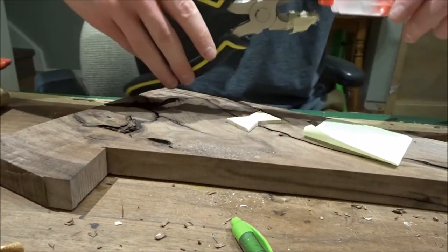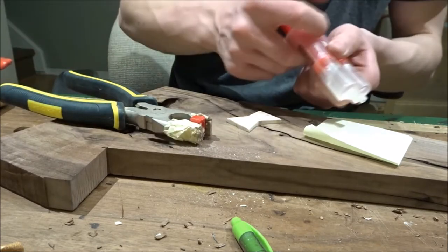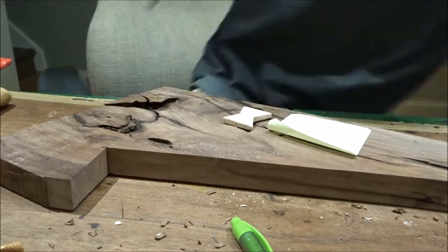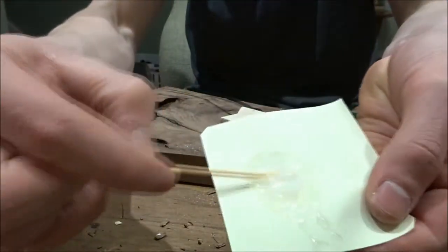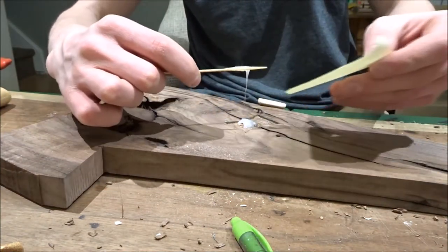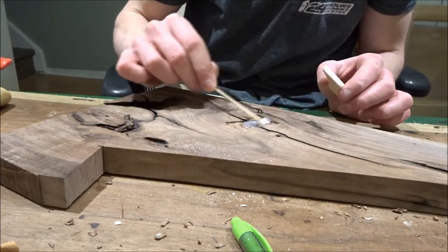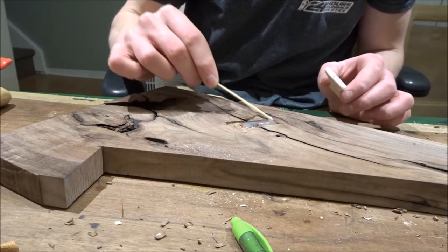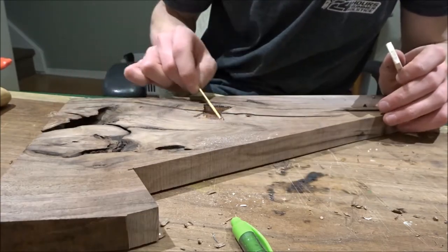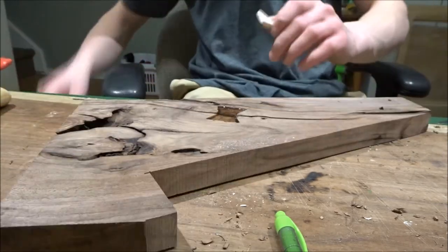Now you're going to want to glue this down. I've never personally used just wood glue — I've always used epoxy because when it dries it turns black, so it kind of matches the cracks in the wood. I didn't have any 90-second epoxy left so I was using some five-minute. You don't really need anything that sets any slower than 90 seconds, because all you're going to do is let it dry and then sand or scrape it down to the same thickness. Get the epoxy all mixed up — make sure you mix it really well so it sets properly — then go ahead and put it in the recess. I usually use a toothpick to mix it; it works the best because it doesn't glob up. Mix that into all of the different cracks and divots in the recess, and get it in every little spot because you want it to hold as tight as possible.